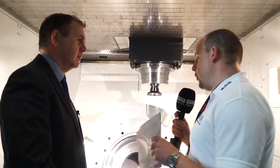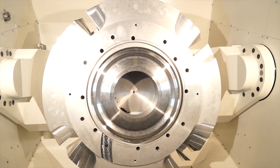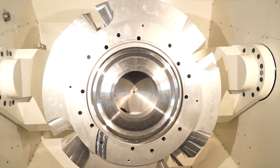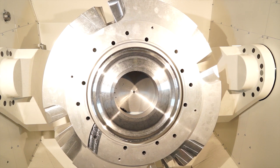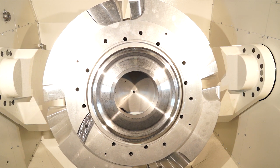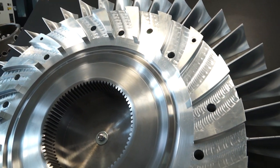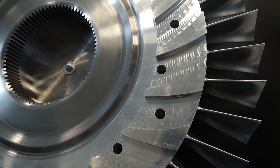Looking at what we've got on the table, that does give us a really good idea of what you might be looking to manufacture if you buy a machine like this. Is there much demand in the UK to machine components of this size and weight? Yes, there is. You can see the example we've got on here — very much targeted at aerospace, and that's probably the main focus for this machine. But it also appeals to oil and gas, large valve manufacture, and anybody doing large size five axis components requiring done-in-one operation — turning, milling, seeing the complete part machined in one operation.